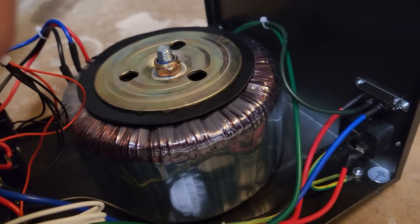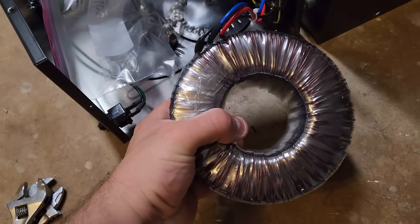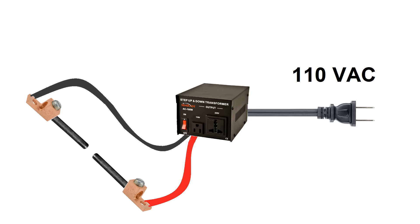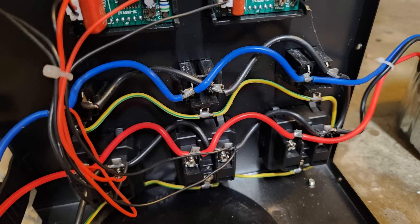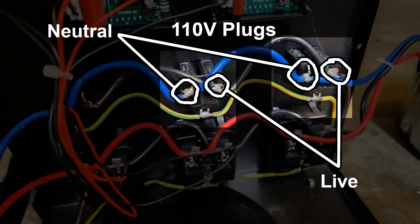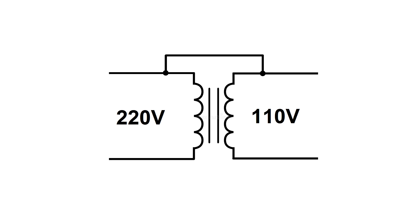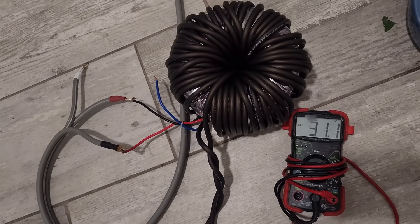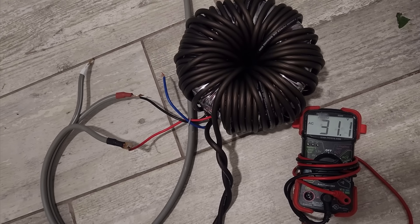Because nothing is removed, they're still usable for 110-to-220V conversion, so you can have a transformer box that doubles as an arc welder or arc furnace. I'm feeding mine from 220V. Based on the wiring when I open up the box, it looks like there are two live lines which are red and black, and the blue wire appears to be neutral if you're using 110V — so you basically have two windings with a common live line between them. I added a new winding of about 50 turns of 8-gauge wire, which puts out 31V AC open circuit when fed from my 220V outlet.